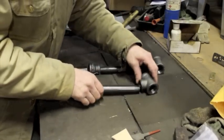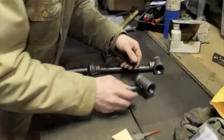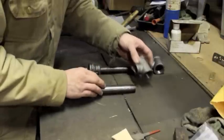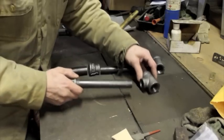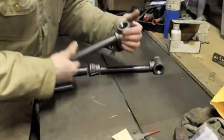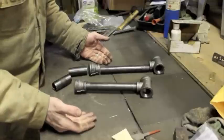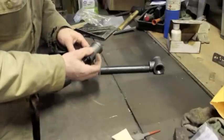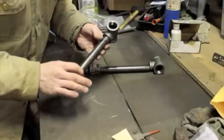So these should do just fine. The Frosty T burner is called that because part of the primary part of the burner is a pipe T. These are three-quarter-inch pieces of pipe, eight inches long — this is three-quarters by one inch. By screwing together a couple of pieces of pipe fittings, you have the basic body of the burner. The way the Frosty T burner works is we're going to put a hole right here to install the jet assembly, in which the fuel shoots down into the main body of the venturi.